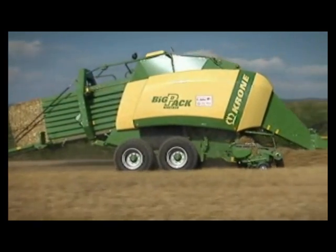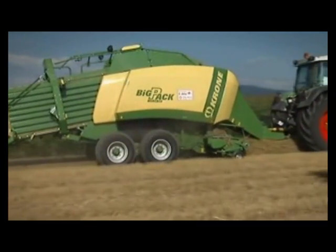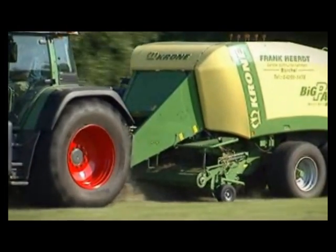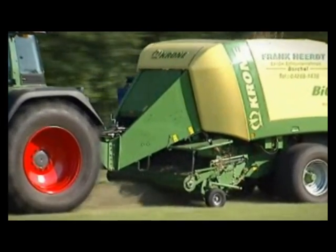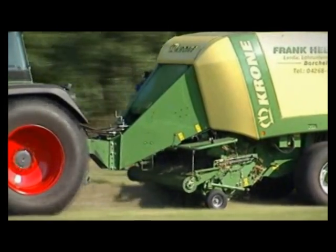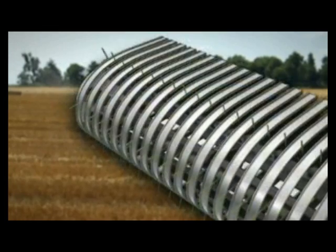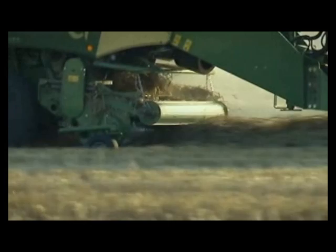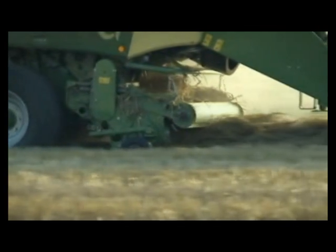Easy Flow offers an effective 1.95 or 2.35 meter working width to DIN standards and five rows of tines that are spaced 55 millimeters apart. The perfect technology for clean rake-ups. The roller crop guard ensures absolutely perfect swathe collection and excellent performance at slow or fast forward speed, in high or low yielding crops, in large or narrow swathes.